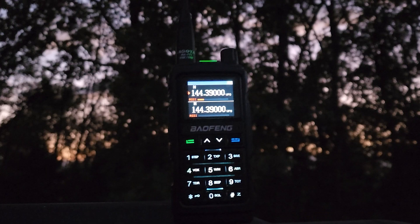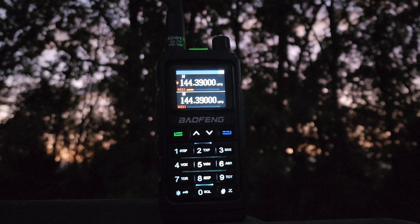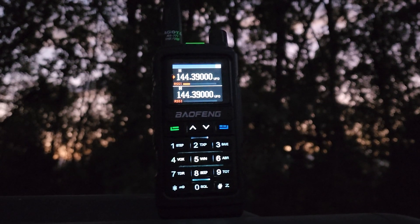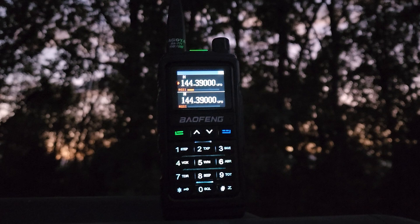When I tested these two radios, the UV5R actually received the APRS packets but I couldn't even hear them coming through on the UV17R at all, even by ear. I tested with different antennas and I used the stock antenna from the UV17R on the UV5R and it did not make any difference as far as getting the UV17R to function. I can receive signals that are very close but those signals didn't come through at all on the UV17R despite it being upgraded.